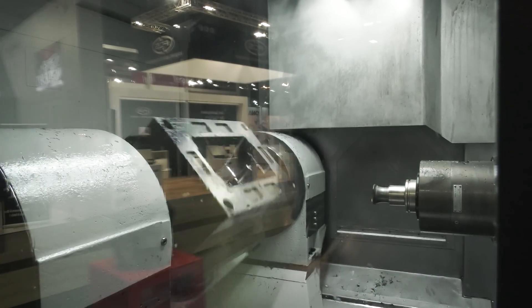Why did Heckert decide to configure the machine in this way? The base itself is a mineral cast base - it's very vibration-absorbing and very stable in terms of temperature, so it doesn't move around. The column sits on top of the base on wide guideways with the spindle housed in the column. The table group, like a bridge, sits on two very widely spaced guideways, so very stable. On top of the table mounting, we either sit a single table, a B-axis table, a direct drive, or a trunnion as you can see with this machine - the two axes sit on a very heavy-duty trunnion system.